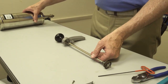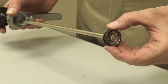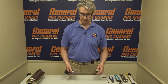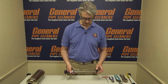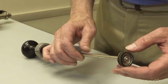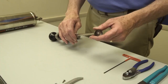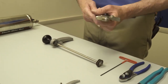Now let's loosen up the handle assembly, unscrew it, and the inner pump assembly will come out. Let's look at the inner pump assembly. Here you have a leather cup, and this leather cup is used to push air down the pressure chamber. If it gets dry or something happens to it, it won't push air and you can't actually build up pressure in the pump. So if it looks dried out or damaged in any way, it should be replaced. There's a new leather cup inside the Ram Repair Kit. In order to get at it, you have to remove this nut, and since it's hard to hold on to the shaft, use the vise grips.